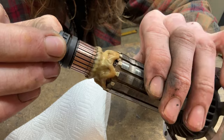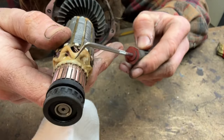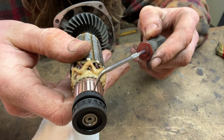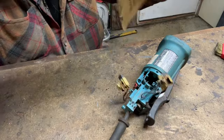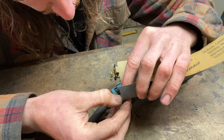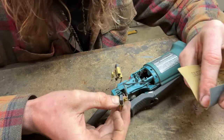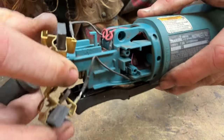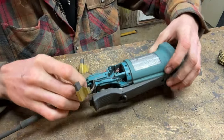I think that'll be a lot lower resistance. This is where I would take a pick, and if this motor had any more use on it and there was a bunch of carbon stuck down between these bars, I'd just clean them out carefully. I'll give that same light sandpapering to the brushes — de-glaze them a little bit. I think brushes are pretty self-correcting. All right, brushes look nice and dull — they don't have that shiny glaze on them anymore. Let's mount them up and see if it works any better.